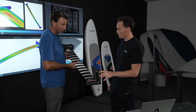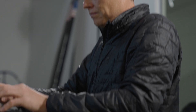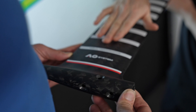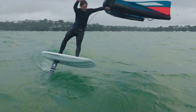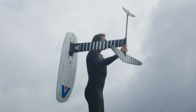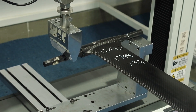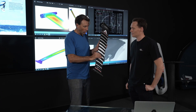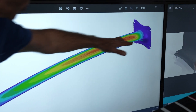That's a really fun part of the project — working with the CFD designer on the sectional shapes and back-looping it through engineering and calculations to make sure we are designing the right section for this mast, covering all possible scenarios. The section development was really interesting because they looked at the hydrodynamics but also the engineering, torsional stiffness, chord percentage, and thicknesses of the section to give us something that would work for the loads we're putting through it. That was really next level for us.